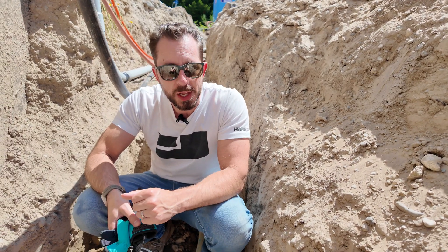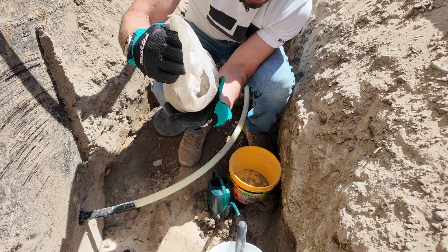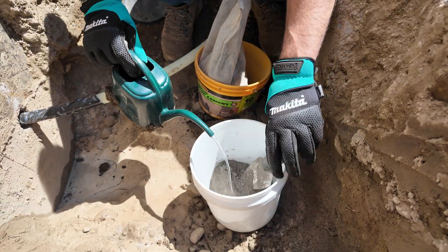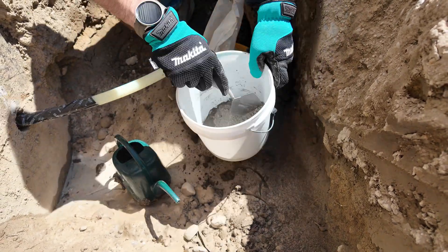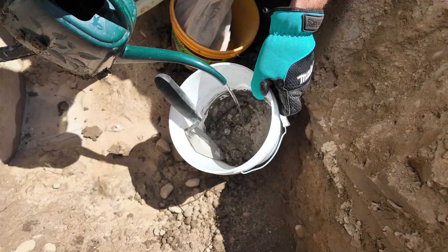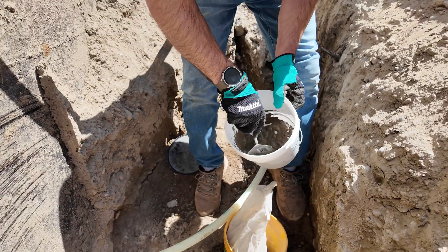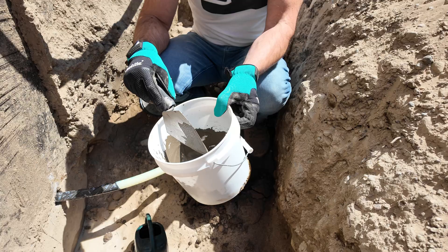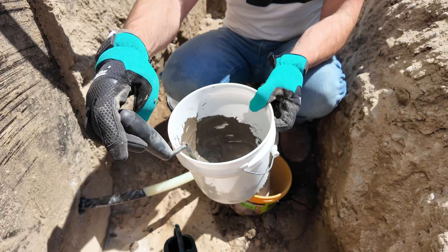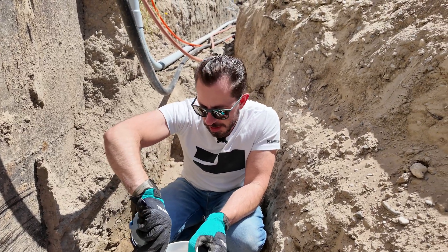Let's go ahead and mix it up and I'll show you how to apply it. You'll see inside we've got the concrete that's in a bag already — just putting a little bit in. You don't want to do too much right off the bat. Now I'm putting a little bit of water in. The key is once you put too much water in, then you have to add more cement and it can just kind of get away from you if you don't take good care of it. So just added a little bit more water, mixing it up, and just about ready to start applying it around that hole. Getting it nice and mixed up — that's a fairly viscous mixture. I'm going to see if I can't make use of it. I actually have the same situation right next door, but if I have to, I'll go ahead and add a little bit more of the Quikrete product. Let's see how this smears on.